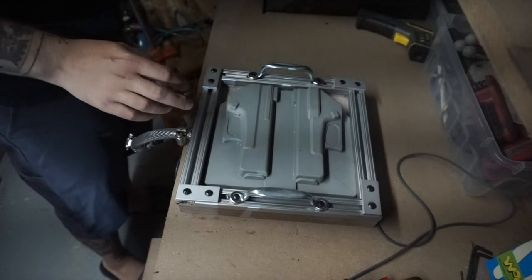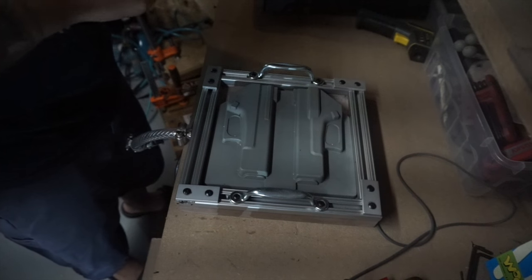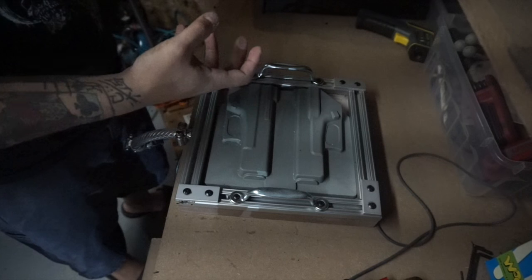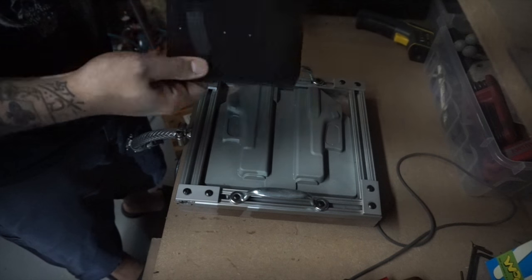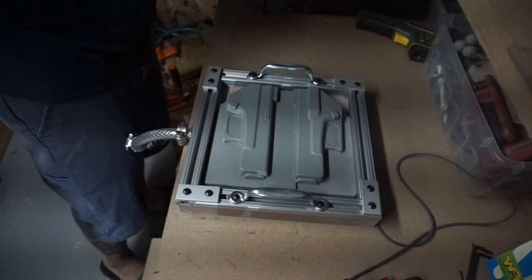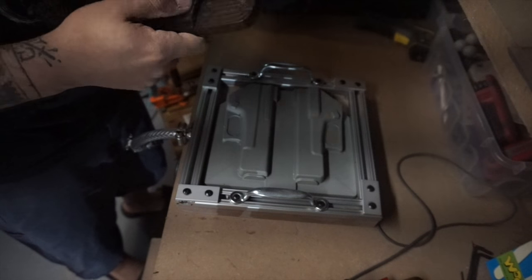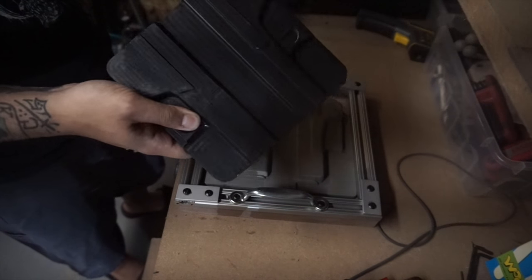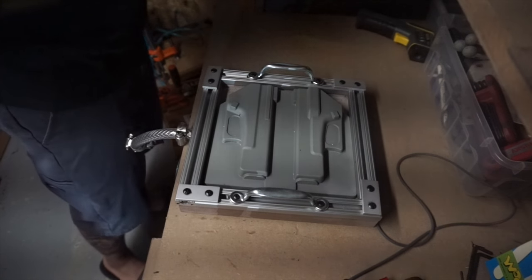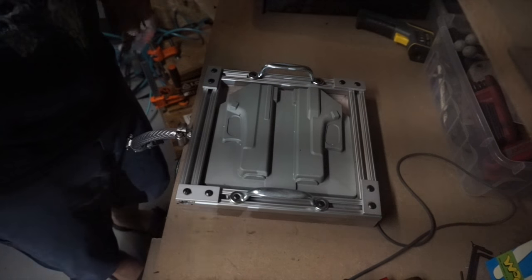I found this is totally compatible with a variety of other molds. Any mold that you have that has vacuum ports drilled through it in order to facilitate the membrane-less forming is going to work. I've been using it for some prototyping on this knife sheath as well. I also have these molds from Andrew Henry that I use sometimes — I need to port one specifically for this process since I was using it with a membrane former initially. But any mold that will fit this, you can make holsters from.